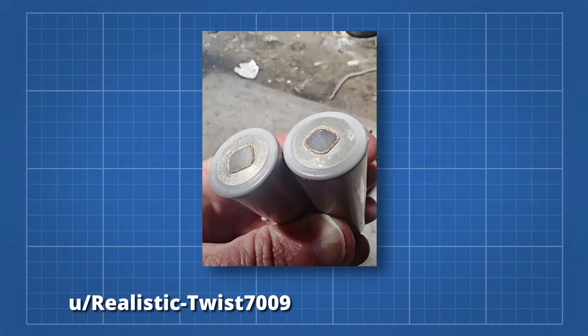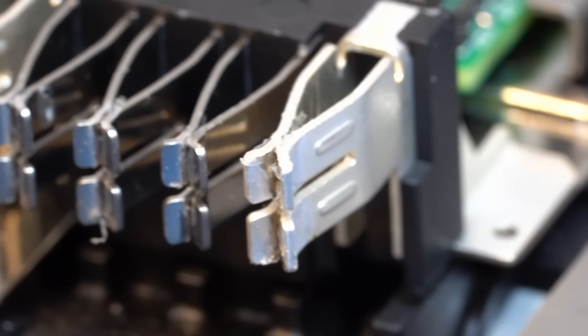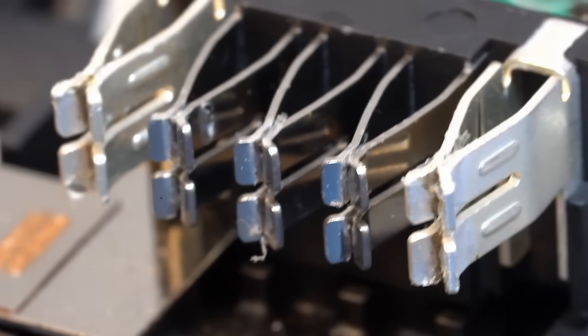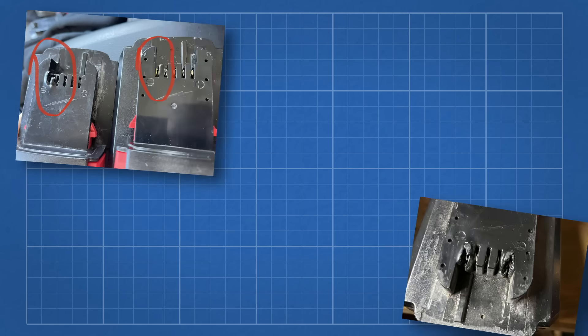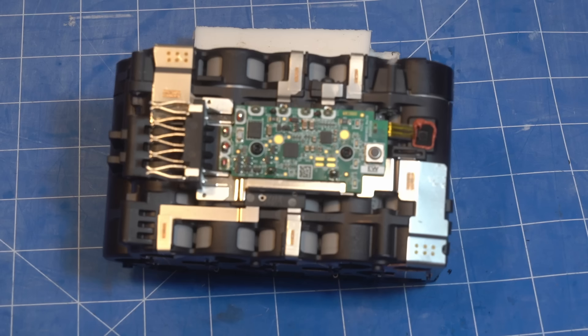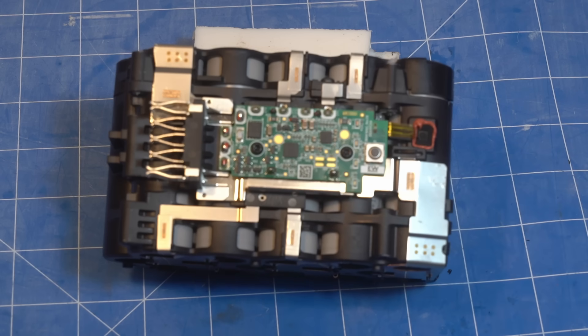That's good for power delivery but not so good for people that like to rebuild their packs. The power terminals are a different metal or at least a different coating — maybe a copper alloy with a coating. They are also much more open which will allow them to shed heat better. Combined with the better nylon housing, hopefully we will see less melted terminals. The thermistor is in a less central location which is a bit disappointing; I would prefer to see the thermistor in the core of the battery where the heat stays the longest.